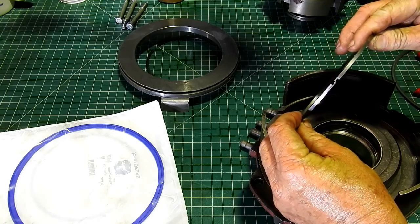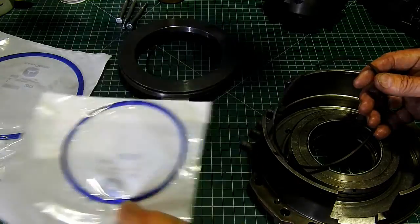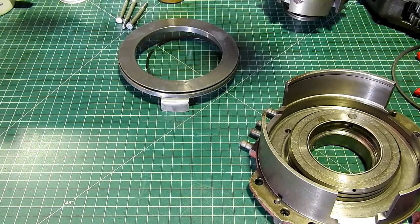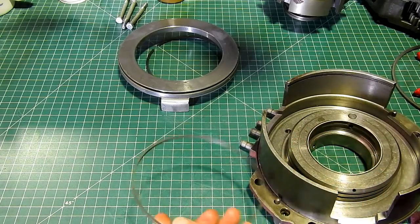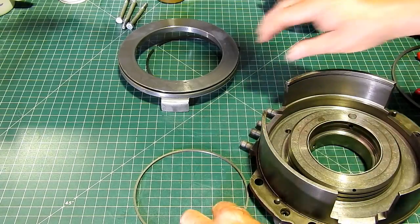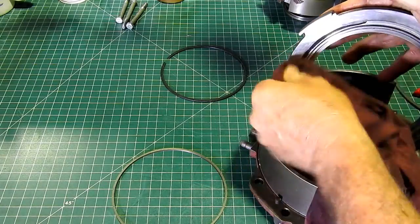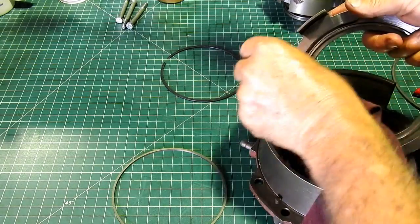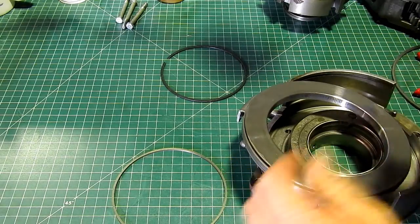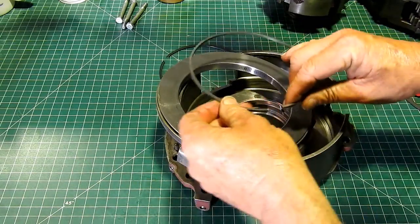So also, we have a hook ring here, and John Deere upgraded the hook ring to this. So another neoprene one, so they can go back under the bench in the John Deere parts section. And look, I'm really pleased with that, I tell you. But look, what we have to do, and it's the same as with any other clutch pack, we have to make sure that these steel plates are not worn, or that the steel piston rings are not worn beyond using them. So if we get that over the centre of the screen a little bit.